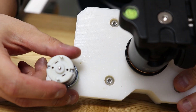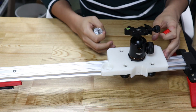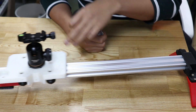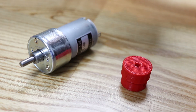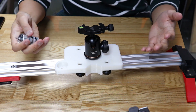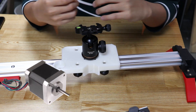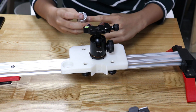So the motor would be placed here and there is a roller connected to the motor shaft. So as the motor turns, the slider head will move along the way. The motor we used here is called Gear DC. The slider needs a lot of power to move a heavy camera. Usually a stepper motor is used, but it consumes a lot of power. So we considered Gear DC would be better.